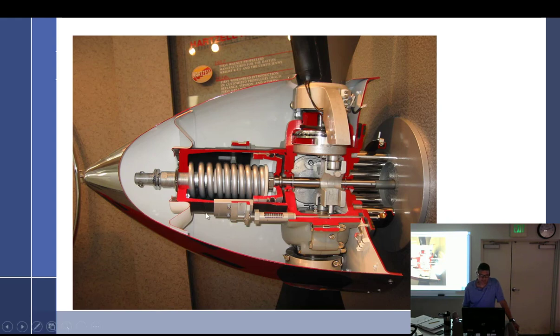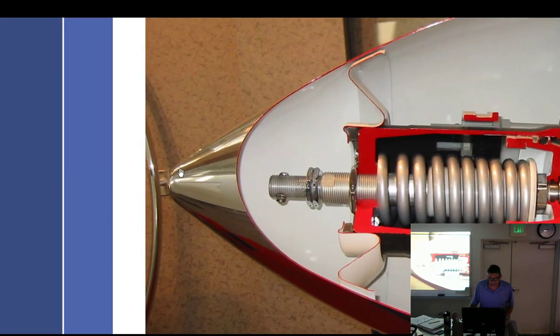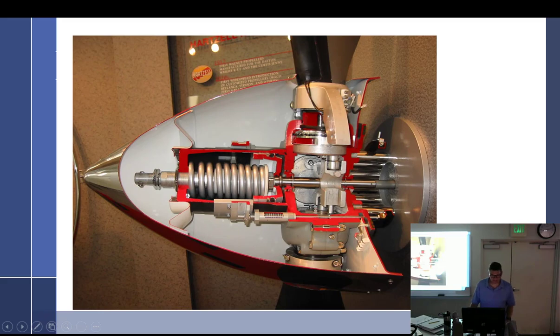All right. This one's definitely a feathering because, A, that is very long. And two, it's got the counterweights. Got a big spring. And what I wanted to do with this one as I was looking at it was see if it had an air charge, and it doesn't look like it does. Because the propellers that take an air charge have a split right here, and the front spinner is only about that big. This little cap, and you take the cap off. That's convenient. Yeah, it really is.